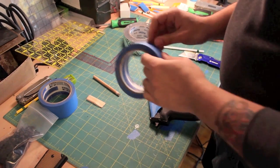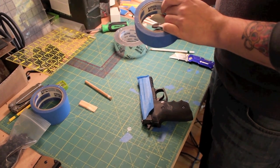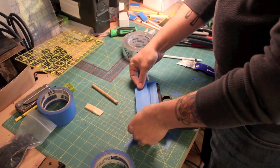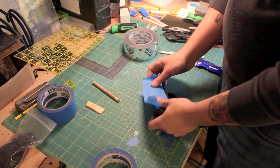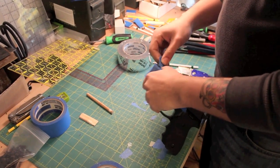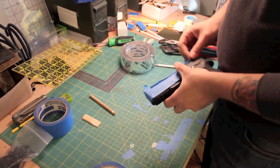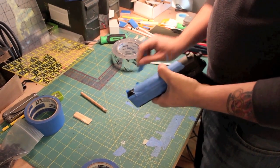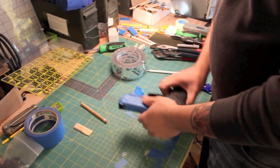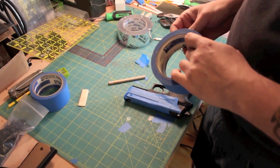I'm going to put a little bit along the top of the slide as well. You don't want it to bunch up anywhere because those bunches are going to come out in your mold. I'm going to come over here, take a piece of dowel, and create a sight channel, which is an important feature so your front sight doesn't get hung up inside the holster.